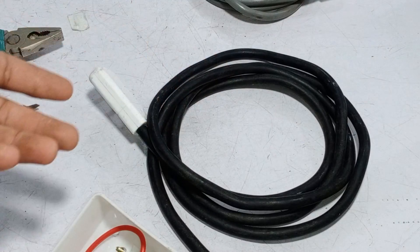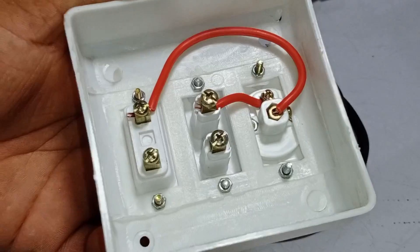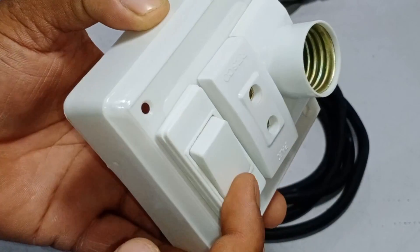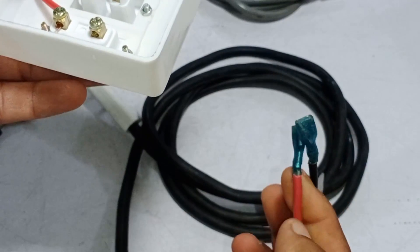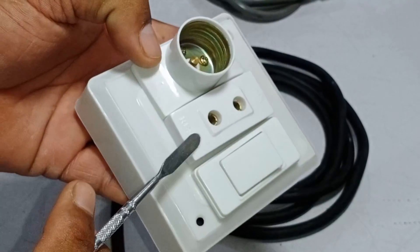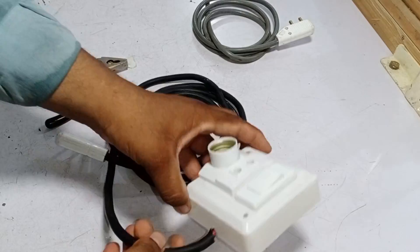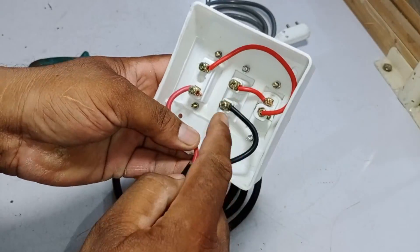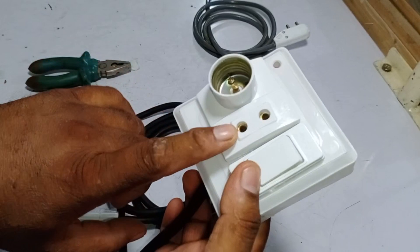The length of the wire depends on your need. Two terminals are left — I will attach one wire to the button terminal. The best practice is to connect the phase or live wire to the button terminal, and the neutral wire to the two-pin plug. The series board will be ready after attaching these wires. Phase wire goes to the button terminal and neutral wire to the two-pin plug, as mentioned.